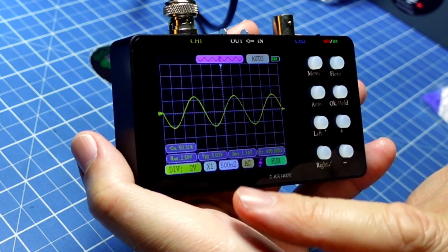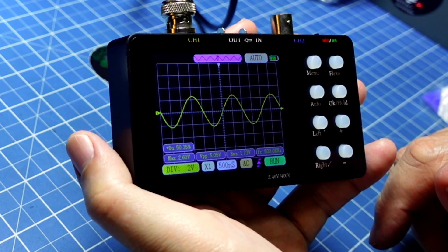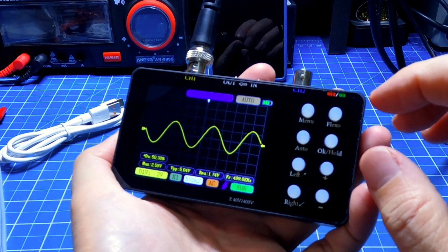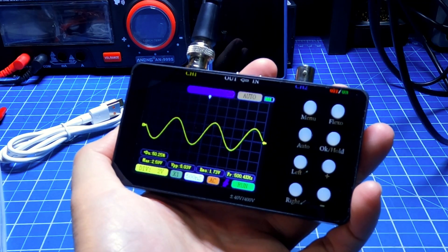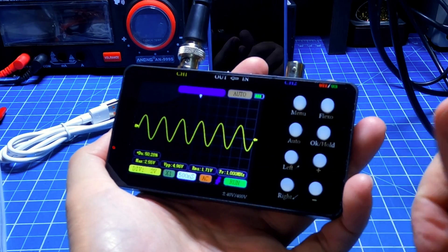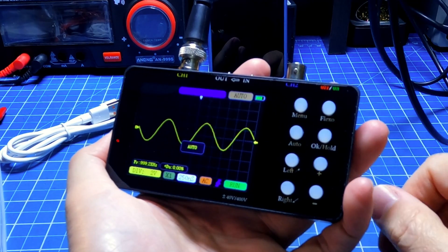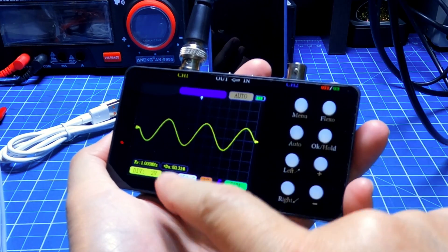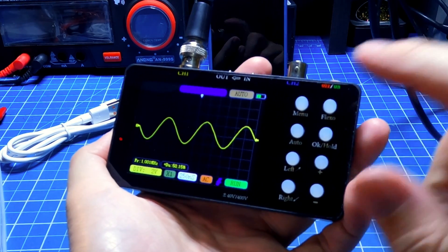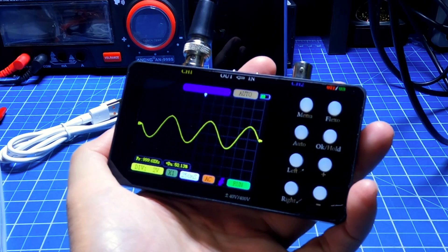The screen is very interesting. Starting now: at 500 kHz, 50% duty cycle — 2.6 V — it measures well, and the peak frequency measurement is accurate. Going to 1 MHz: still measuring well — duty cycle, maximum VPP, frequency all reading 1 MHz correctly. However, when I press hold at 1 MHz, it loses the measurements. Without hold it measures correctly, but pressing hold above 1 MHz it no longer shows measurements.